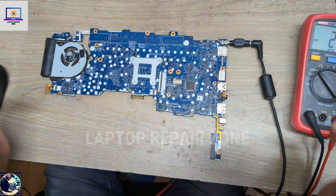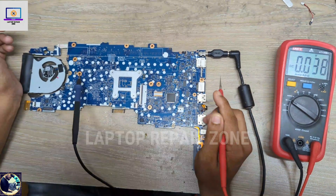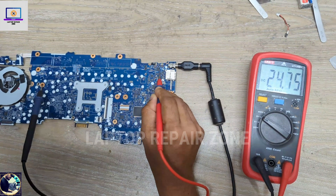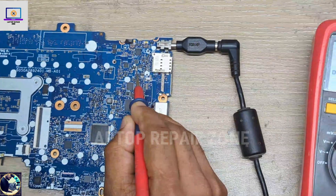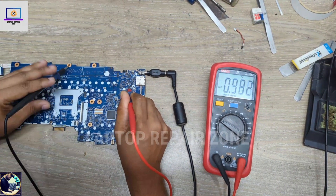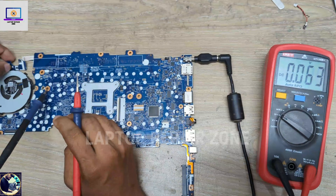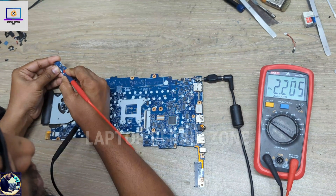In this case I will measure some required voltages on this motherboard to find out what's wrong. First I need to set my multimeter to DC mode. I'll check the main voltage — 19V — it's good, I also get 24V. Then I check this current sensing resistor. This also looks perfect. The switching voltage is 2.2V — this is also okay.